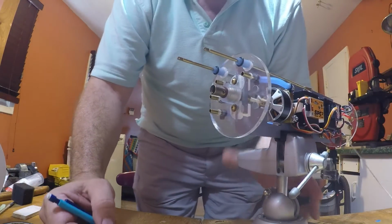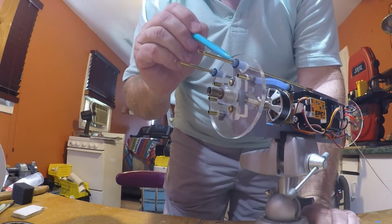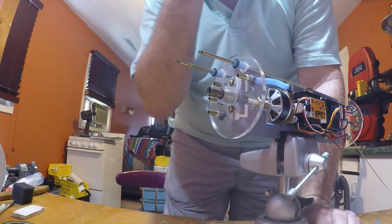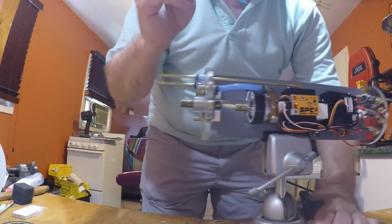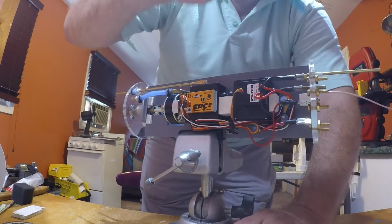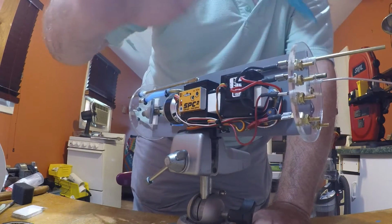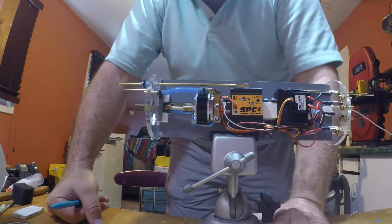Okay, very quickly, I want to just discuss my seals. This is nothing more than 1/8 inch ID silicone tubing, fuel tubing, you guys know of, with an actual 3/16 O-ring over it just to keep compression. And the lining tubes are Delrin tubes that I put through the acrylic, and I'm going to do another video on how I do that. The same method will be used for the gland to seal the coax cable. But that's pretty much it.